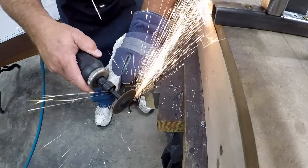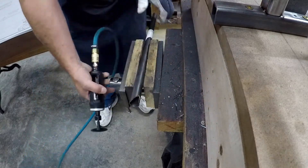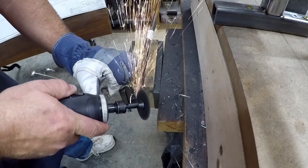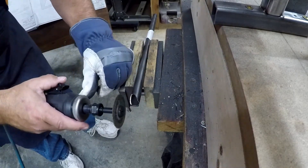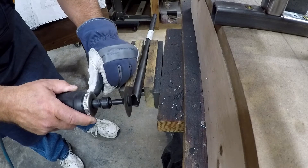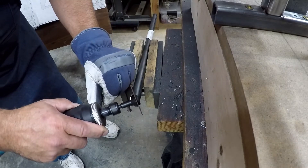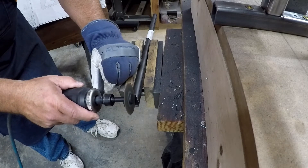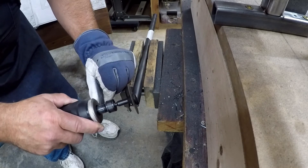After I'm done cutting the slots I can come in with the blade and cut the remaining pieces away, so I'm not spending a whole lot of time slipping off the curve. I find that stepping it over the thickness of the cutoff wheel works well, and once those pieces are gone I can come in and side-wheel very gently and bring it right to the sharpie mark.